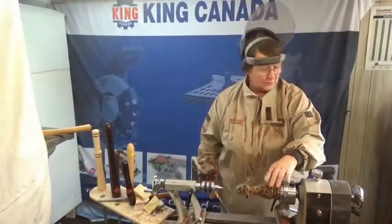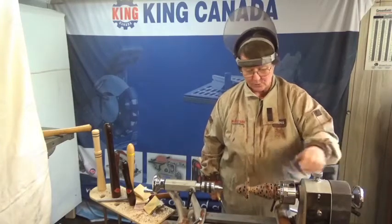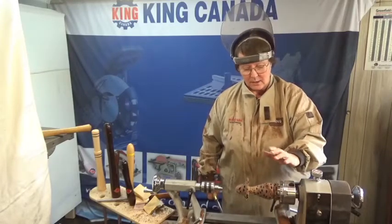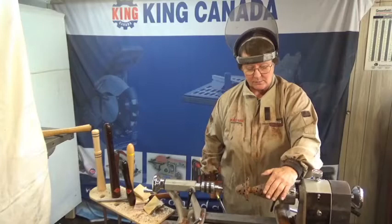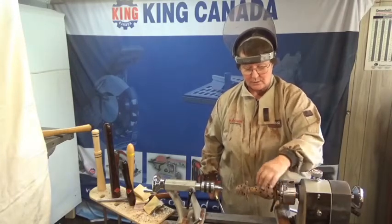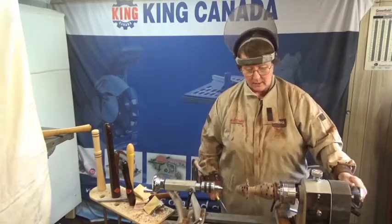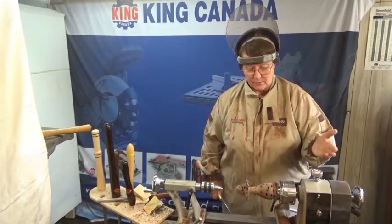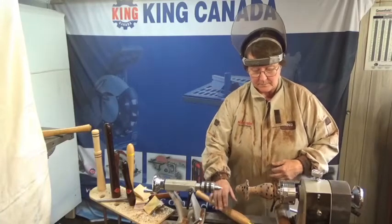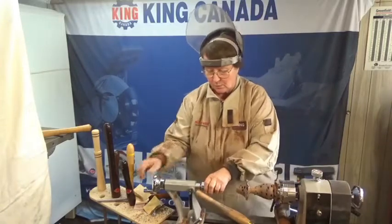Now, if you were doing a wooden one at this point, if you wanted to use a finish such as the Yorkshire Grit and Hampshire Sheen, you could apply it, okay? I would not use it on this material for the simple reason that the waxes would get caught in all of these pores that are here, and then you'd have to dig them all out later, which is kind of a pain. I find just taking this and very carefully using a spray lacquer works extremely well.